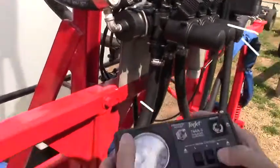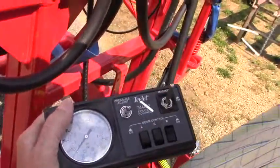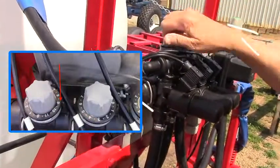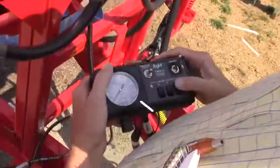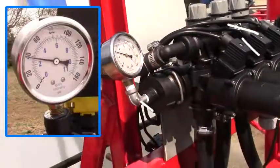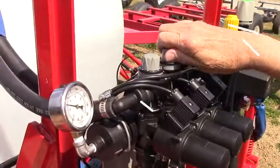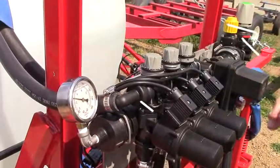We turn the right one off — this is the right on this side, controlled by this one. We'll go to 9. You can now see that we're up at 9 and the pressure is right back to 40. Let's try the center one. The center one moved a little bit. As we turn this out, you can see the pressure go down — so it's right on 40.